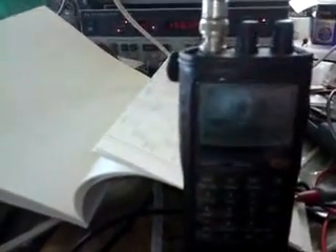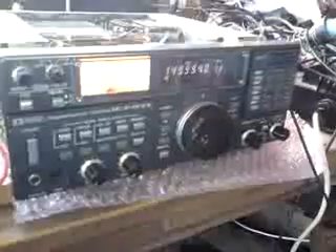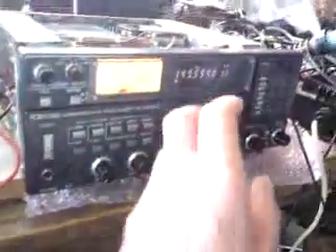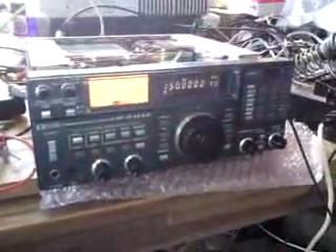That's marvellous. One thing the Uniden units — which decode a lot faster than this — don't do is go down to 10.7 MHz; they start at 25 MHz, which is a shame. But maybe you can triple 10.7 MHz and use the instant CTCSS and DCS decoding features of the Uniden series in order to do stuff with this radio that was never conceived when it came out. So yeah, there it is.